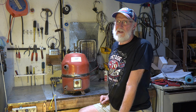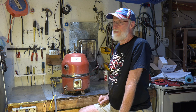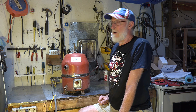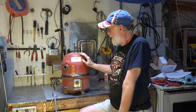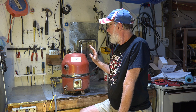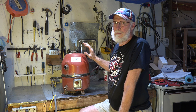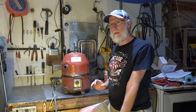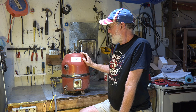You used to see open compressors, but not really anymore. The hermetic has taken over virtually all the compressor market except some very large ones. This one here is a Trane — it's a piston compressor, and I think it's a two-cylinder opposed configuration.